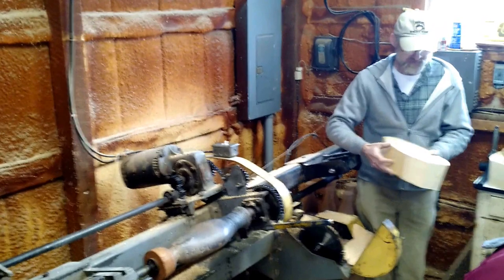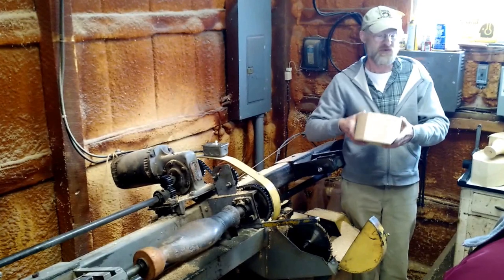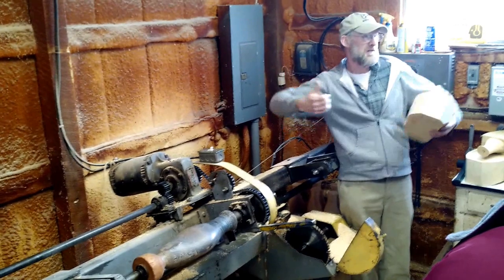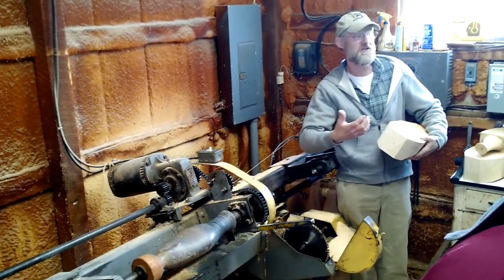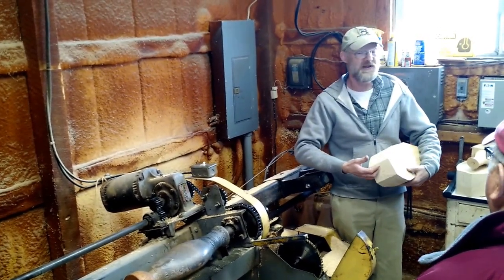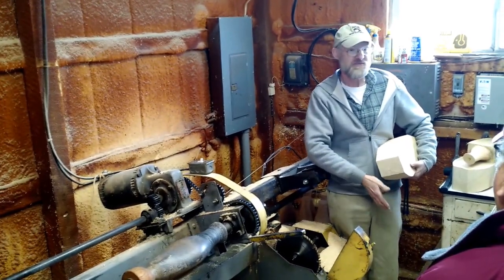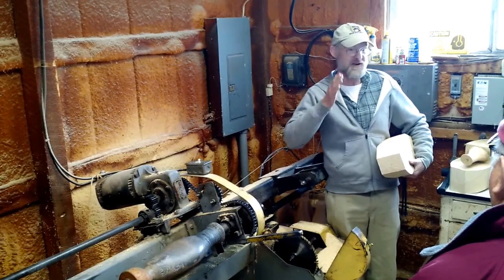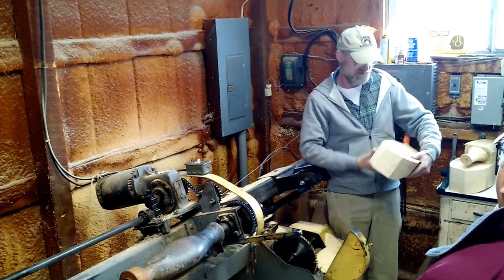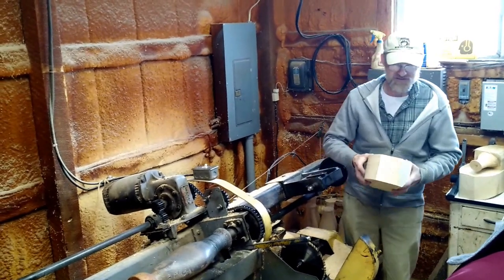But generally white pine. What I try to do is cut so it's clear of all the knots. When you get white pine, you walk past some big logs. That's how the wood starts. I get it as trees. Most of it I get from the tree trimmers, and they know how I want it sawed. What I want is it sawed right through the knots. Everybody wants to saw a white pine right through the nice narrow soft spot. Well, that just ruins it for me. If you leave a knot right in the middle, that'll always bleed through the paint. So I don't want the knots.